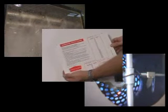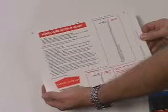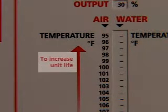Continuing our example, the sun sets and condensation begins to form with the cooler evening temperatures. We are interested in a different temperature combination that maintains our moist air level, but may reduce the condensate. Using side 1 of the calculator, we round our 29.2% output up to 30% and put this value in the upper window. Observe the tips shown on the left under air temperature.